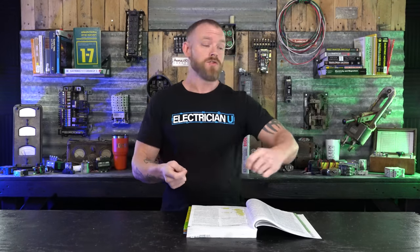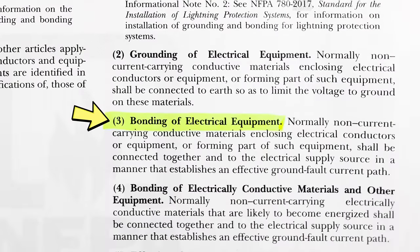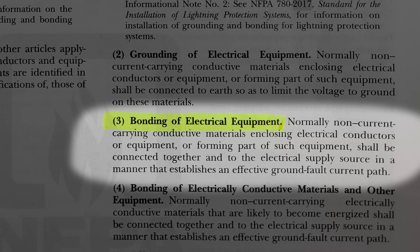When we're talking about grounding, we're talking about the grounding conductor — the conductor that goes out to a piece of equipment and hooks to the metal stuff. That's what we call 'ground' out in the field, but it's the grounding conductor. In code, they call the neutral the 'grounded conductor,' but they also understand there are some things that you ground that are not a neutral and they are still grounded conductors. Just remember: in code, 'ungrounded' and 'grounded' refer to the hot and neutral, and the 'grounding conductor' with the -ING is the actual ground we talk about in the field.